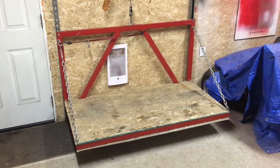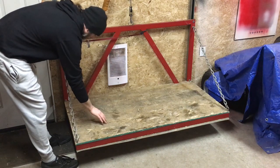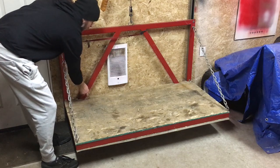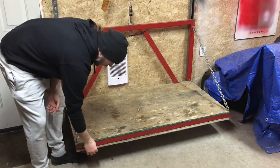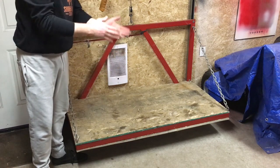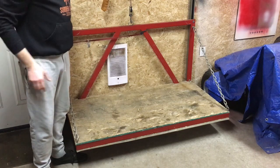To finish talking about the platform itself, it's just got a simple piece of half-inch OSB. The eye-bolts on the bottom keep it in place, and it's cut out to fit around the parts of the back frame. Along the outside, I've got weather stripping, so when this is up in the hole overhead it seals up and allows me to heat the bottom of my garage without losing too much heat up through that hole.